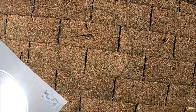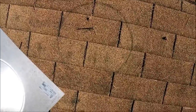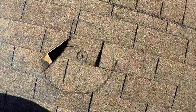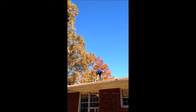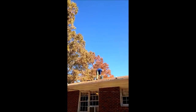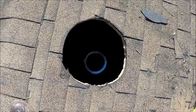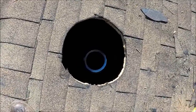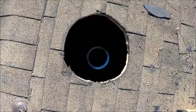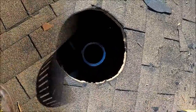There's my mark with the grease pencil. Next thing is to make a hole in the roof so I can use the sawzall. You can either do that with the back of a claw hammer or the way I'm going to do it is to use a hole saw. That hole saw was dull as a hole. Instinctively, this was the toughest part of the job for me. I did not want to cut a big dang hole in my roof. It goes against every fiber of a homeowner's being, but there I've done it. The worst is over. You can see the chimney pipe in the attic — this is just set in place to test it.